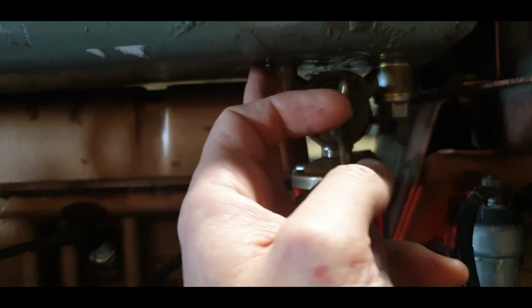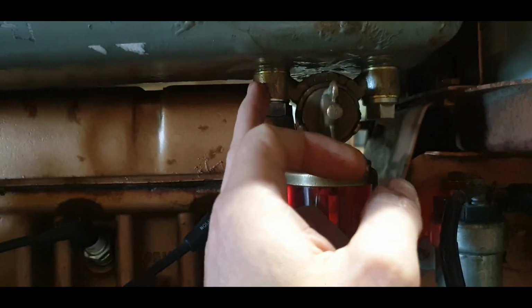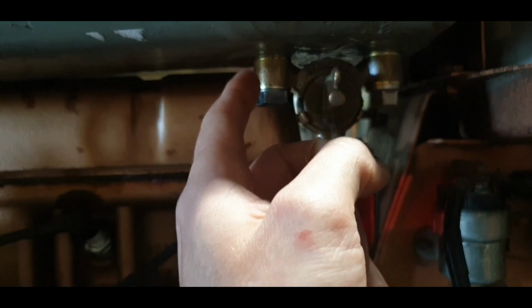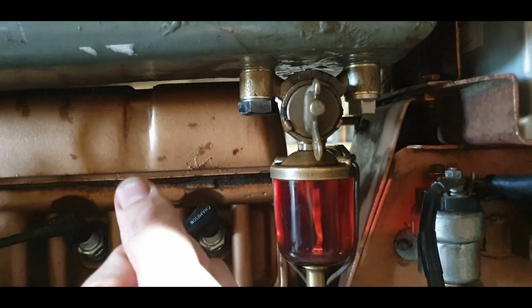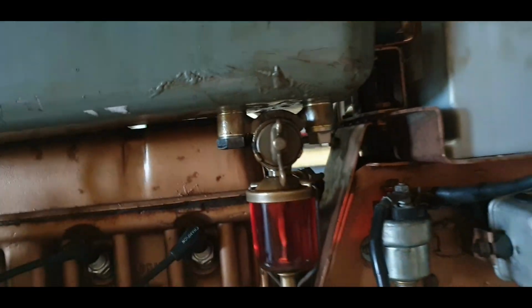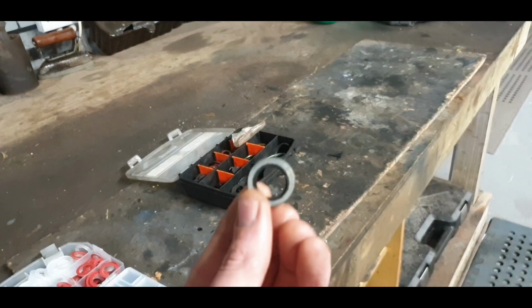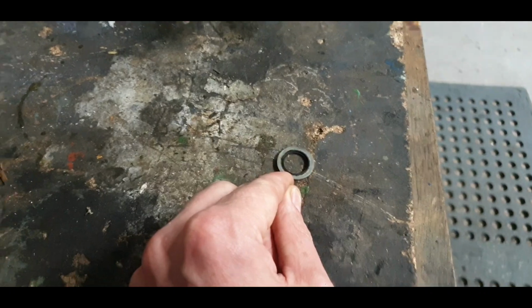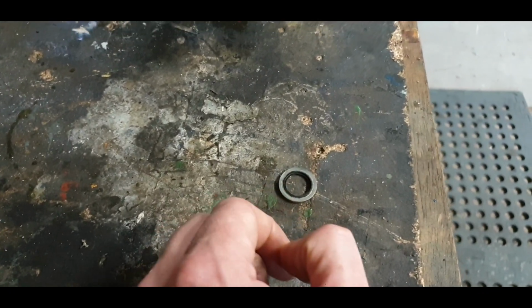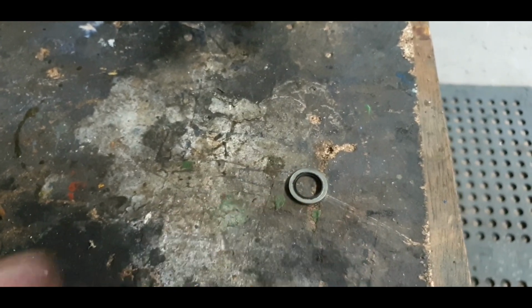It looks like there was a bit of work done on these threads before, and when I take this tap off, you'll see that the amount of meat on the insert, the brass insert that's threaded, is just a lot less than this side here. So that's why there was no harm in going slightly wider there. But it also means the Dowty washer, if we look at our Dowty washers here, because there's basically a wider kind of tube for the threads insert, this rubber lip here just doesn't, it's hard to get it lined up perfectly where it'll seal. That is the issue, I think.